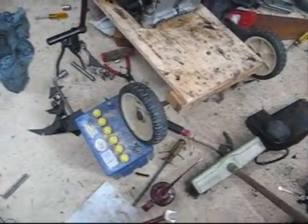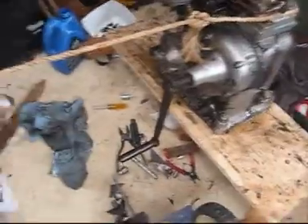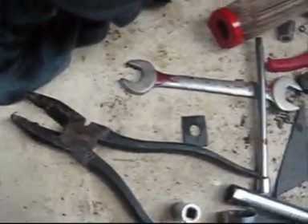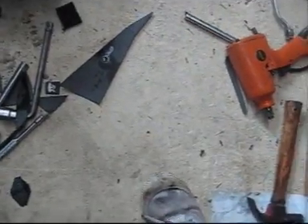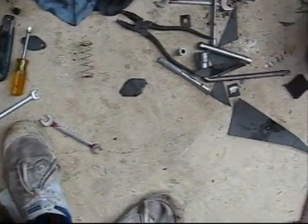I'm leaning it over with this battery, and as you can imagine I don't want it falling. So what I've done is tied a rope around it and tied it up to the wall — I don't want those wheels slipping out and it falling off. So now I can undo the oil filter and see what needs doing. I've just stuffed a rag in there to stop it leaking because it still leaks — I've probably lost about a liter of oil. I got all excited ready to put the filter back on, took the rag out and it started leaking again, and I've lost the little fuel filter — it's probably still in there actually. So now I've just got to put that spring on and then the gaskets — I made three of them because I think it needs a bit of thickness.